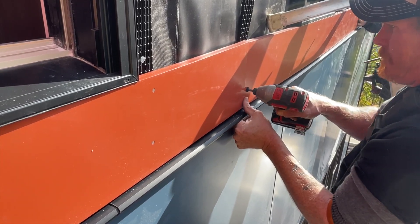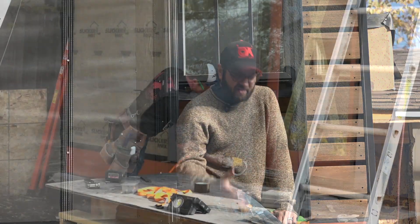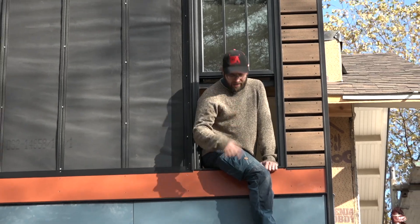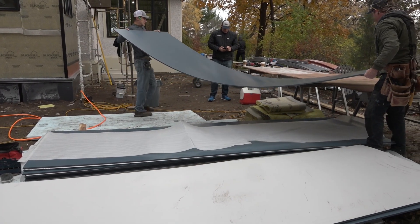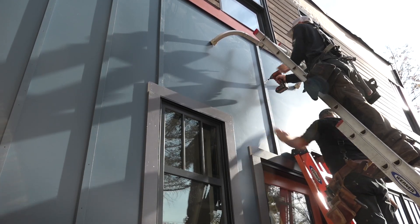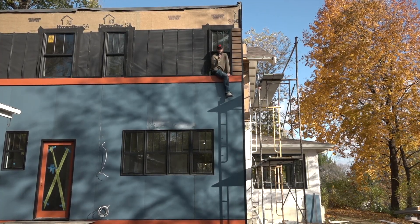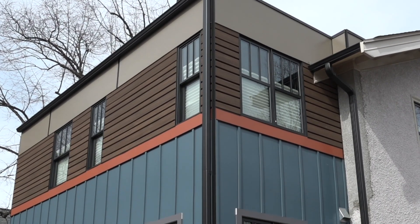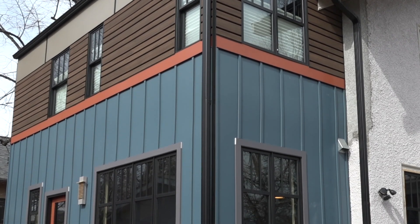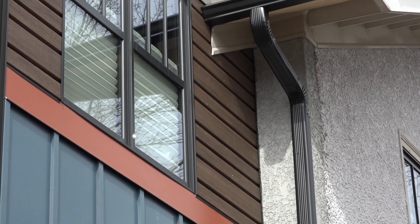This time we're going to open up the show by talking about cladding. We are using two primary types of cladding: PVC panels and PVC decking that's wrapped in vinyl. The PVC panels are actually two different kinds of panel. The panel below me is a half-inch thick PVC panel from Azek, called their PaintPro panel because it's super easy to paint. On top of that we're going to put a three-quarter inch thick PVC batten. Up above we're going to put a three-quarter inch thick panel — more of a panel and channel, a more contemporary look, where the board and batten is a little bit more traditional. For our open joint we're using the Azek cladding, which is 100% PVC decking that has a vinyl wrap.